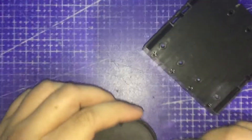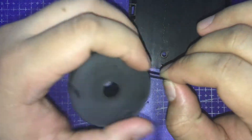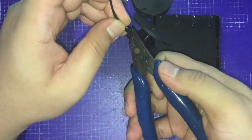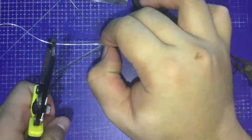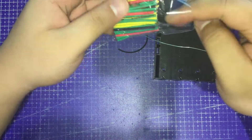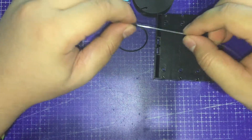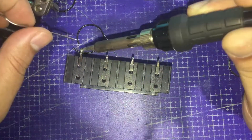Next up is the battery holder. Now we're going to cut a piece of hookup wire to connect onto the battery holder terminals — just going to eyeball it. Cut another one with the same length. Then use the stripper to unsleeve both wires. We need to check if the heat shrink tubing will fit just to make sure. Now we're going to solder wires onto the ground terminals, but we need to add some soldering lead to them first.